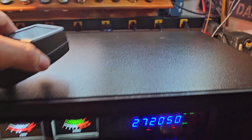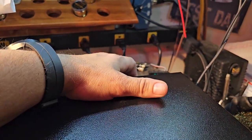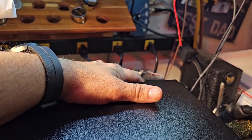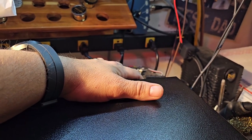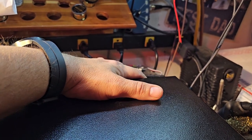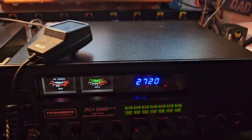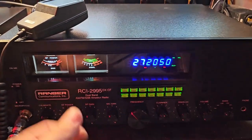We got a barrage of switches right here on the back, and they are all labeled. You got an amp on off switch over here. You've got a high cut noise filter. You've got a VFO wind up, and you wanted it 2 seconds. It's exactly a 2 second slide. And then you got another switch here for your echo. There's the echo adjustments right here on the back, but you can just flip this off and on. That way you don't have to adjust the echo once you get it set right, okay? Let's just go ahead and show you what the radio's doing.